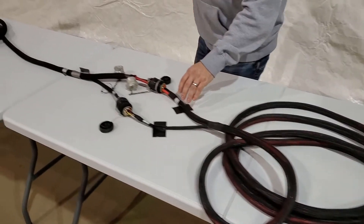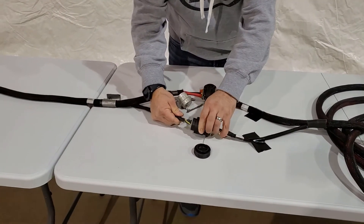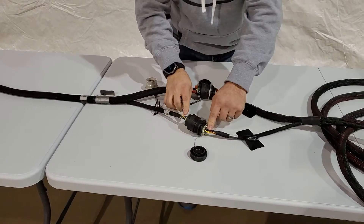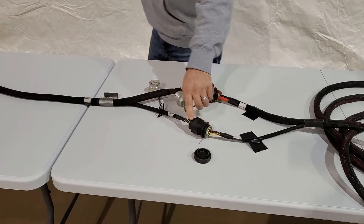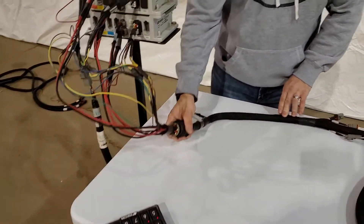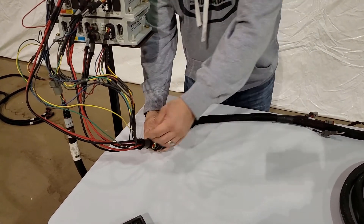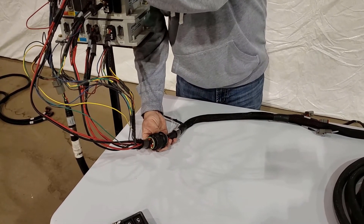Following back, the wires go all the way to our rear and front implement harness connections. Here you can see the purple and blue wires in these connectors. They go through that and come up to the ECU breakout where the blue wire splices off — one set going into the ECU breakout, splitting three ways into each comms plug on pin 17.